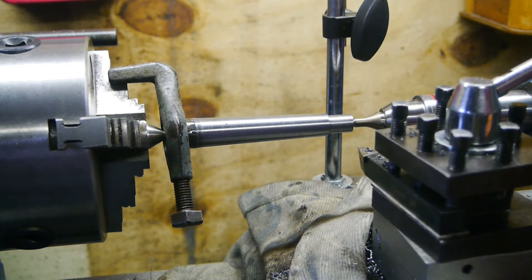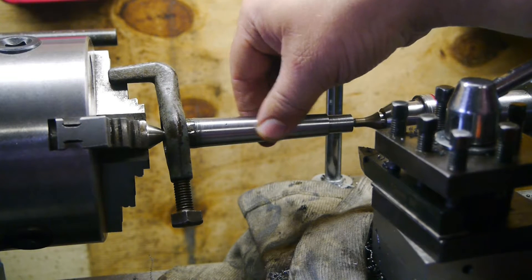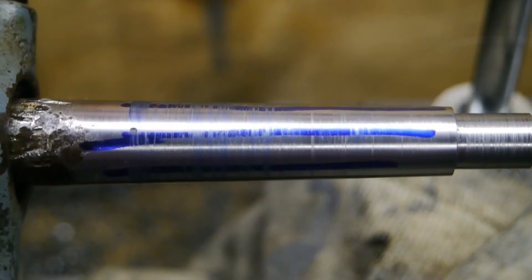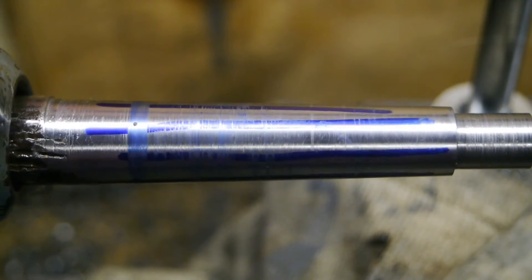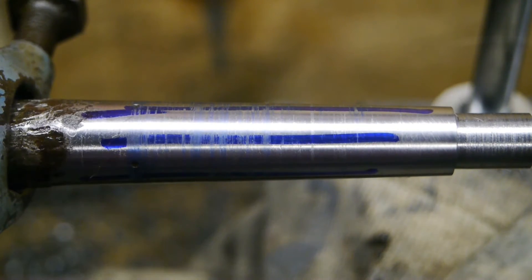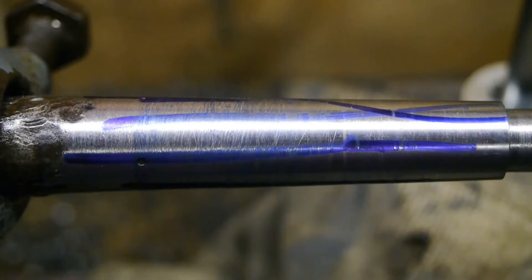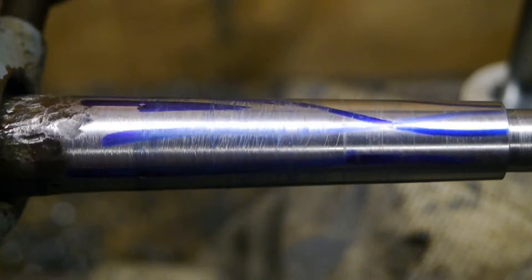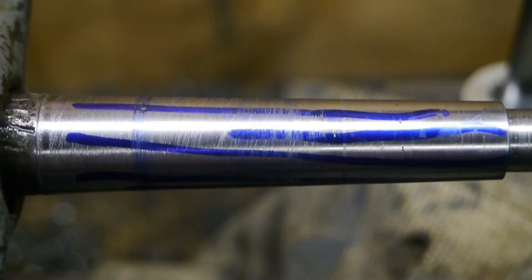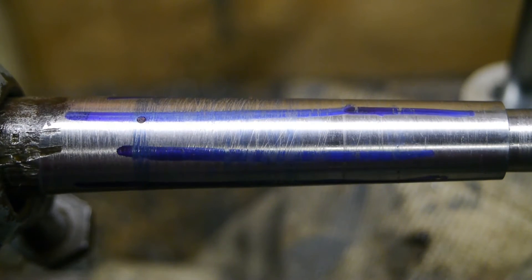Orange shirts make great rags — and it has nothing to do with not getting into the European Championship. I put on some blue marker lines and test fitted it in the tailstock, and this is the result. It could have been better — it's mostly binding at the thicker part of the taper. This is how it looks after the second test fit; I think it's a bit better, but not much. I'll polish it a bit more and then turn the piece around and start working on the threaded end of the arbor.